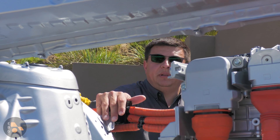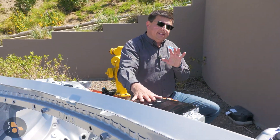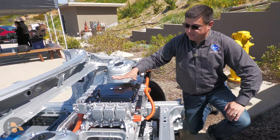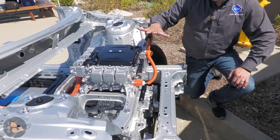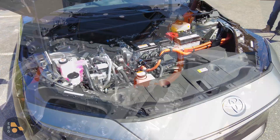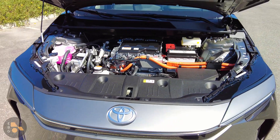The e-TNGA platform was not designed to have a front trunk like we find in some EVs out there. Instead, Toyota decided that they wanted a more pragmatic shape for the vehicle and a more compact front-end design. So under here we find the DC to AC inversion components and the AC Level 2 charger — this is the AC Level 2 charge connector right there that plugs into that charger module. A lot of parts commonality with other vehicles in Toyota's lineup is definitely seen in here.